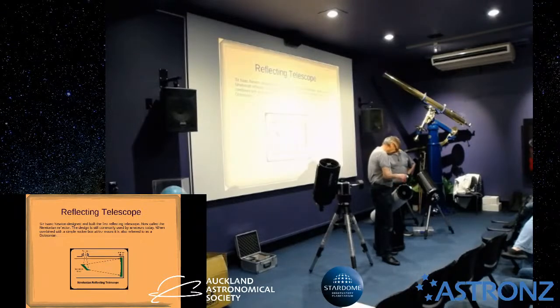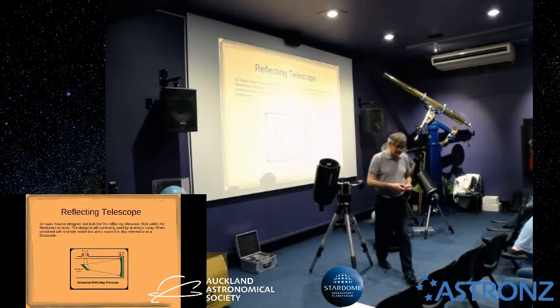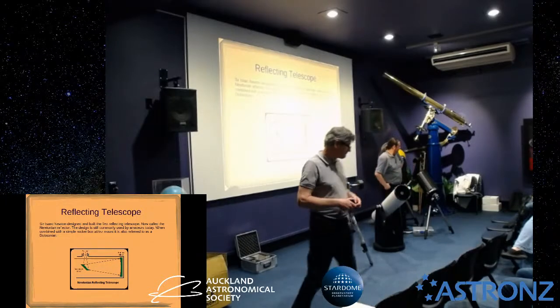And one of our members was saying he tries to collimate with the laser, but it's never working, he just makes things worse. So we said, I'll bring it in and we'll have a look. And that was the problem, he was using the wrong kind of adapter. So, yeah, that's just a gotcha to be aware of. Most of the collimators come with a 2-inch adapter now, anyway.